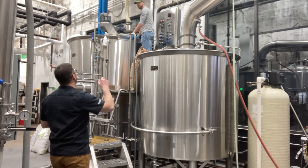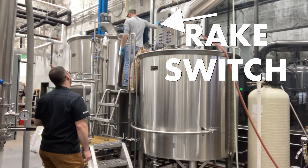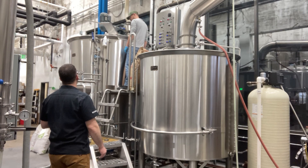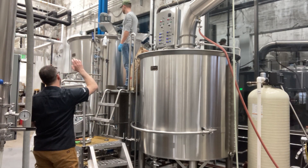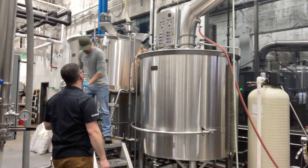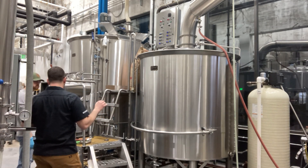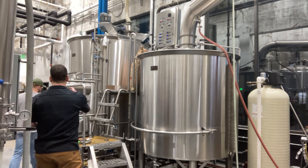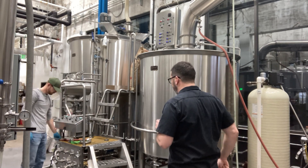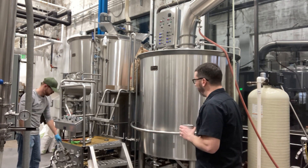I like to double-check just to make sure that my rake is working — just flip it on real quick. I hear it, you hear it. Give a visual on all your valves right now. Make sure the top sparge ring is closed and your full line all the way down is great. Hot liquor tank is back up to 165 so we can cut the pump, and then we're going to make sure all of our pressure points for water are closed — two valves over here and one valve down here. Bust that hose off, set it over here, and hang the union from that port and blast a little bit more through.